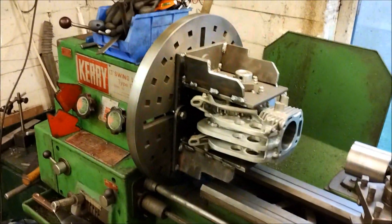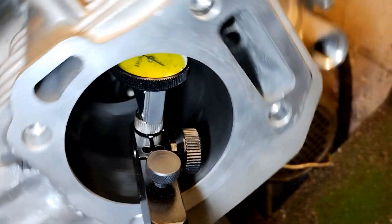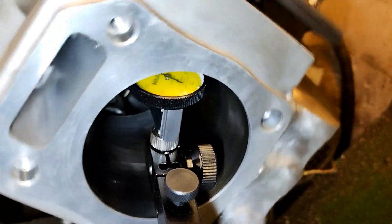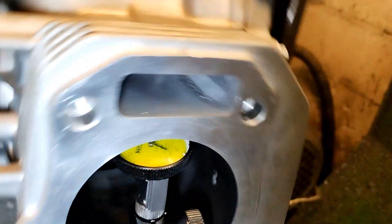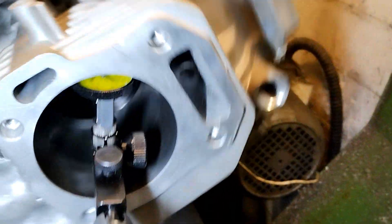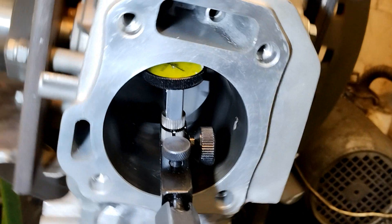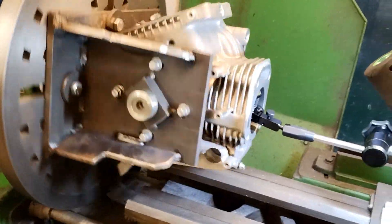Now it's time to start taking the old sleeve out. I've now dialed it in and it's a little bit out of shape — you can see it on the dial indicator just there. But the rest of it is spot-on. This is how we're on there at the moment. If I move it further in, it's just where it's slightly out of round. Alright, ready to machine it.